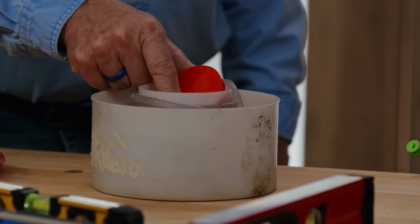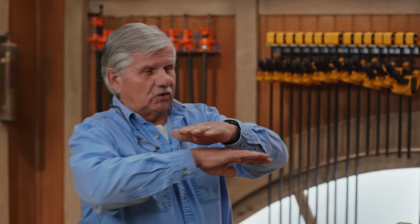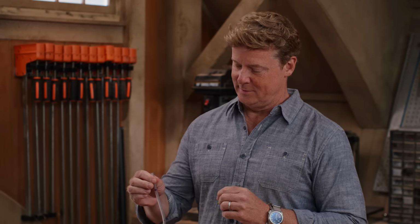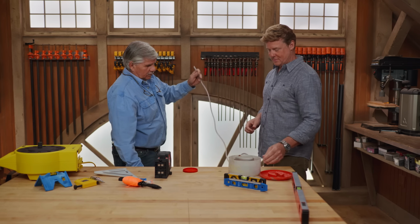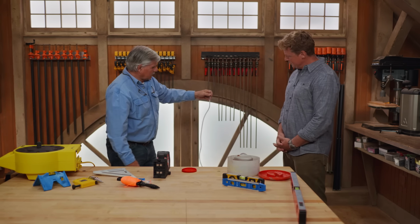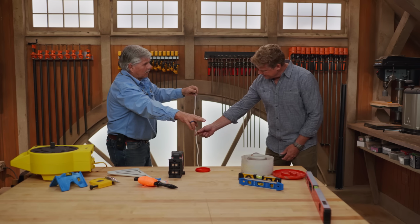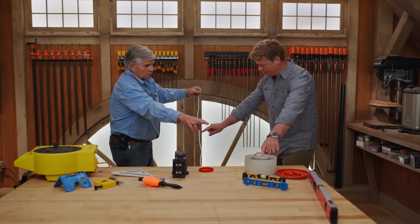It's actually a water level. So basin of water filled up almost to the top, and then you've got the tube going around, which comes out. So think of water. You're at the beach and you look at the horizon over the water. That is exactly level. Always is. Water seeks its own level. So I fill that with water, and I fill the tube with water. And now, because water will seek its own level, wherever that water stops, that's the exact height of that water right there. This point, that point, identical.